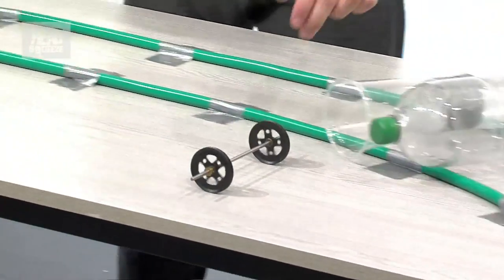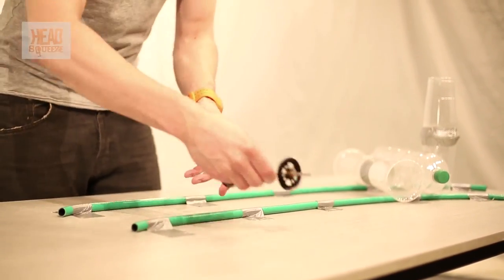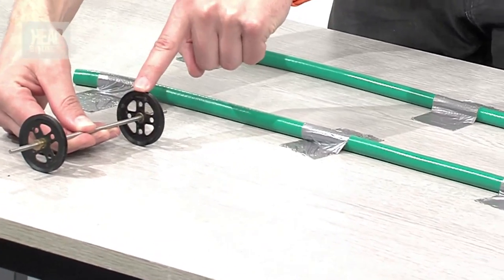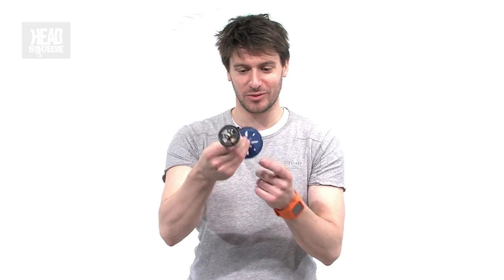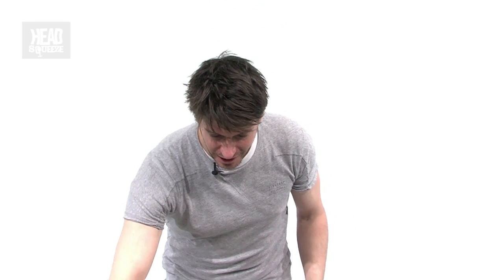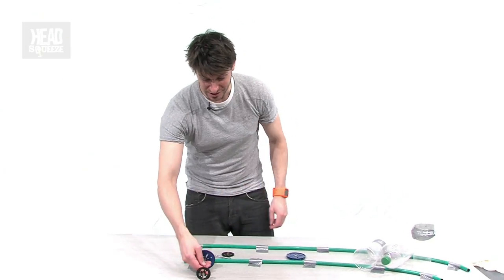And that's great for when you're going in a straight line — down it goes. But if we want to go around the bend, because the outer side of the bend is longer than the inner side, you need the wheel on the outer side to turn faster. But you can't do that because they're on a fixed axle. So the other way to get wheels on a fixed axle going round the bend is to have that outer wheel bigger than the inner one. Now if we have a much bigger wheel on the outside than on the inside and let go of it, it will only want to turn. No surprises really — you'd expect that.